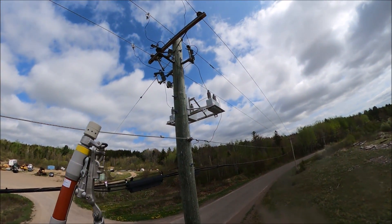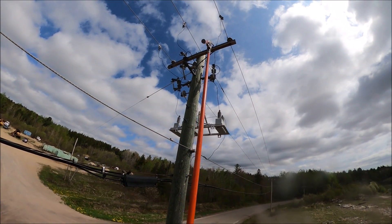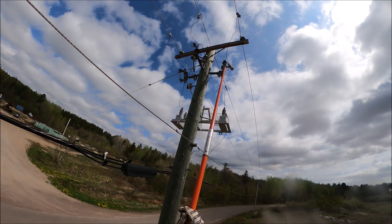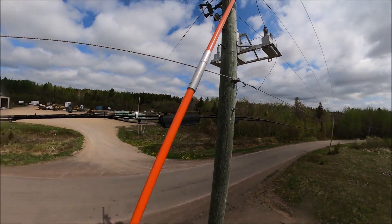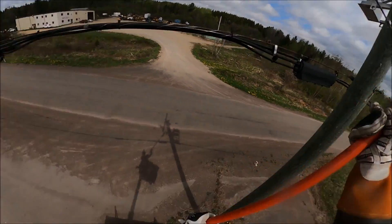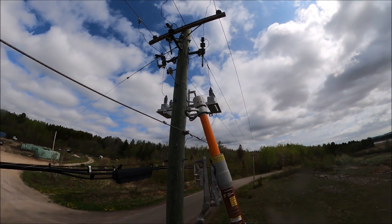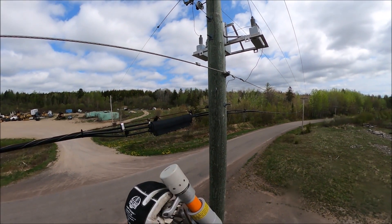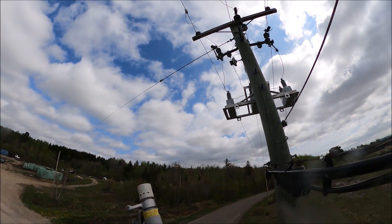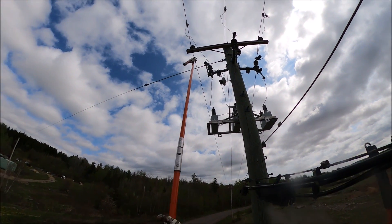When using your load buster device, it's always easiest if you hook it on the side opposite to you. Here I don't have a whole lot of room between them two phases, so we're going to hook it on the front side. You can see where that pin is — there's not a whole lot of room between them two phases since the center is open.